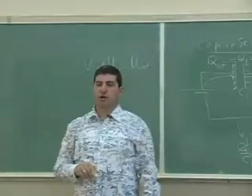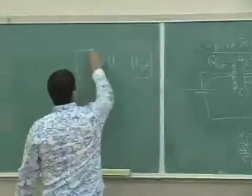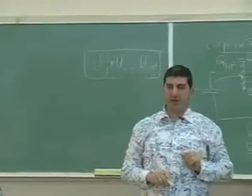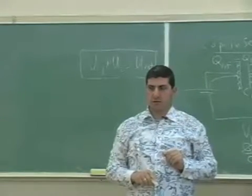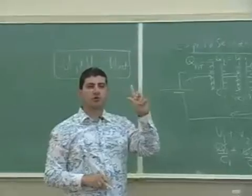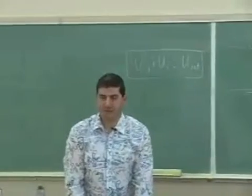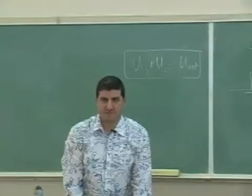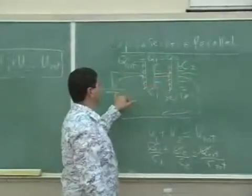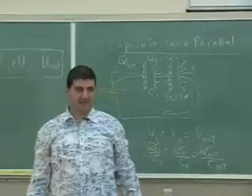Now how could I derive that? Let's say I want to derive it. Remember there are three formulas for the potential energy: half Q squared over C, or half CV squared, or half QV. Which of those three forms should I use to derive this equation for the series circuit? What is the same about all three of them? Their charge. So use half Q squared over C.